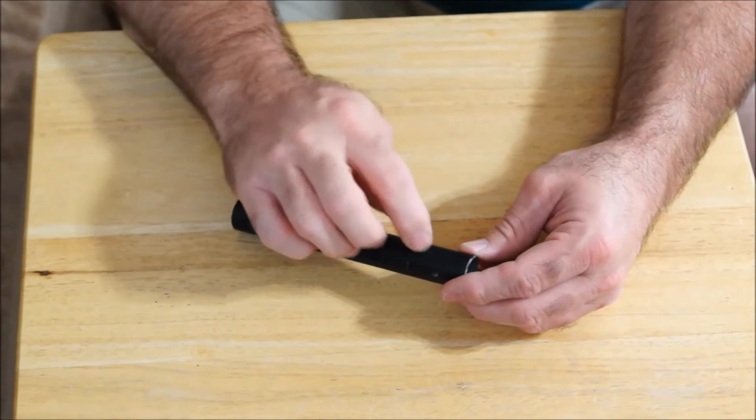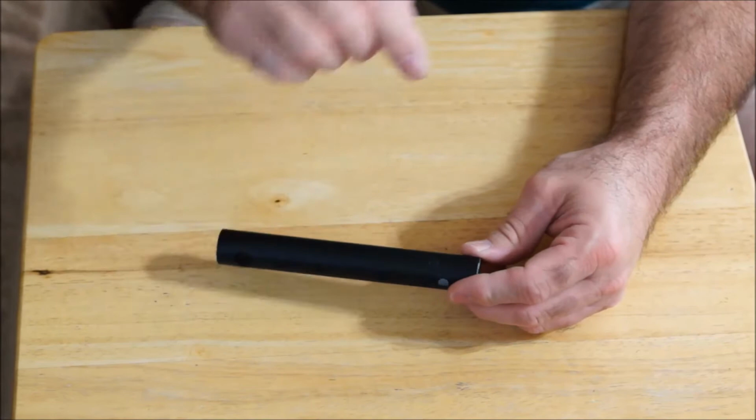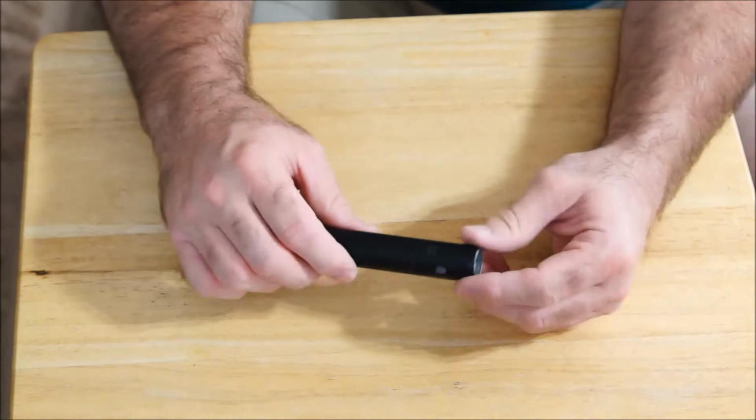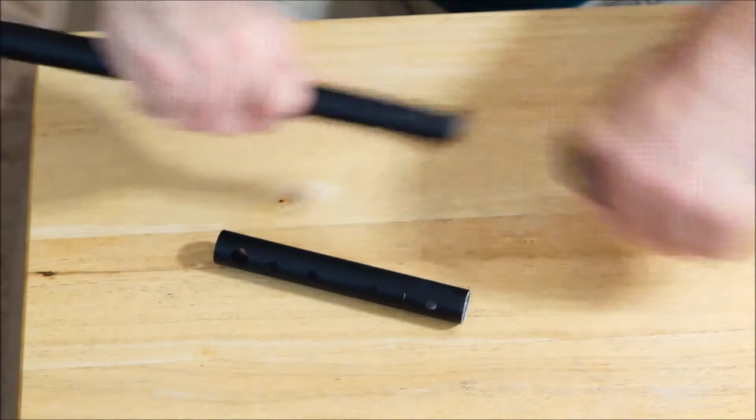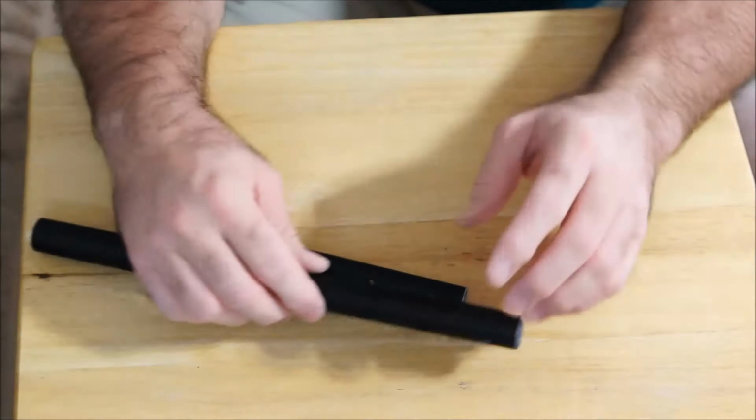If you just try to drill straight through, there's a lot bigger chance that you won't have them lined up correctly, and then your screw may need a little work to get it through. You may have to enlarge one of the holes slightly or something like that, and we want to avoid that if at all possible. So get that tube. Got this tube. Still, see, I've got my 1.5-inch marks here, so I know it's fully seated. Drill one side, then drill the other side. So let me do that, and I'll be back.